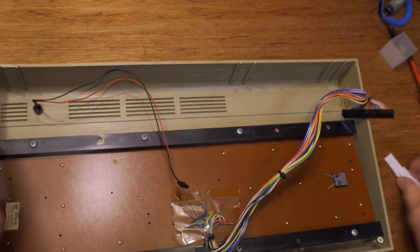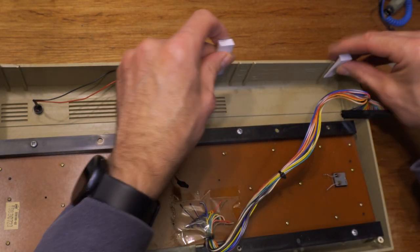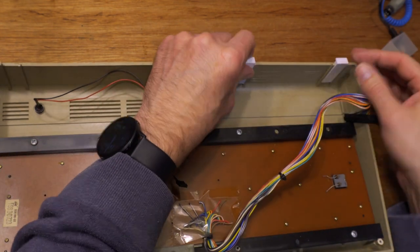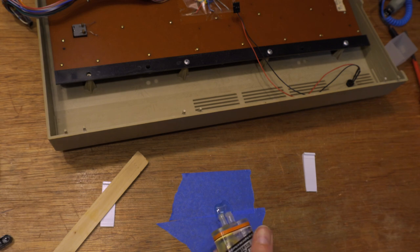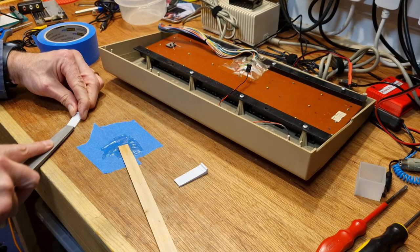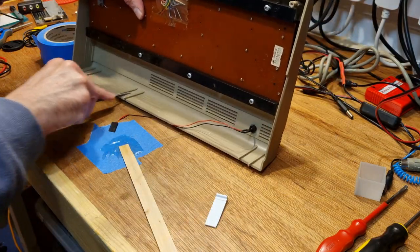The last thing to fix are the case clips. I've 3D printed some new ones. Link in the description for the Thingiverse file. The way these are designed is quite clever. There's a ridge that guides how high the clips should stick up above the edge. Two-part epoxy is probably the best glue I have available for this type of work. I've made sure to scratch up the two surfaces to give a good key.